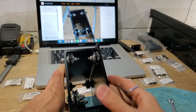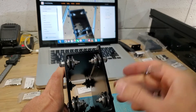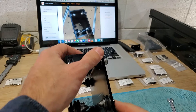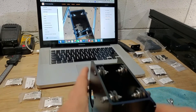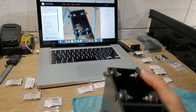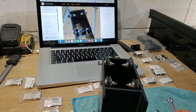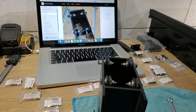Be very mindful of how tight you are making your nuts on the gantry. I noticed that on the ones with spacers they were prone to over-tightening and the bearings were getting a little crushed. I had to loosen them so that everything slides nice and smooth. If a bearing gets bound up you're going to burn a belt or throw everything off, and the consequences could be catastrophic.